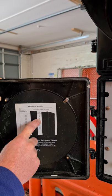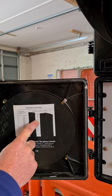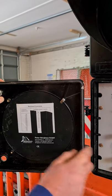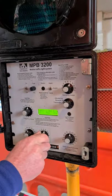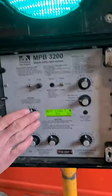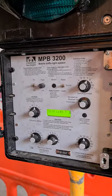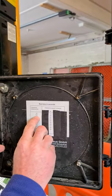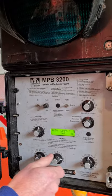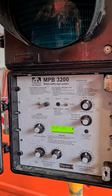It's important because if you don't measure correctly, you'll get someone going on a green when the other vehicle hasn't cleared the site. It's measured from where your stop-go operators would stand — where your traffic lights are. Don't guess — count the white lines on the road, they're 10 meters apart. Be accurate. So at 200 meters it's 28 seconds: enter 20 and then 8 as your second digit. At 100 meters it's 16 seconds: enter 10 and then 6.